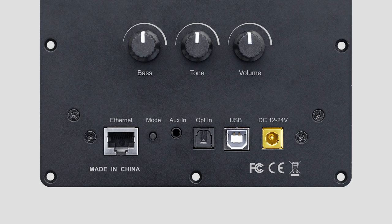The acceptable power input is 12V to 24V. If you want to achieve the maximum performance, you can use 24V power input with 4 ohm speakers and 2 ohm subwoofer for a 50W x 2 stereo power output and a 100W subwoofer power output.